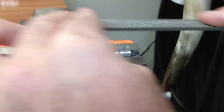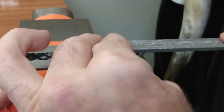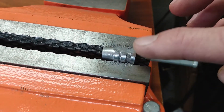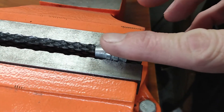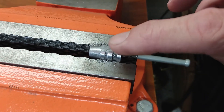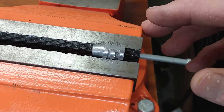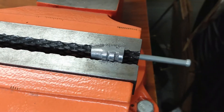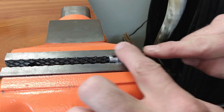You do not want to take a nice finely made American file and plug it up with lead. Now, I've got it filed down pretty well to where the lube grooves are flush — one nice flat spot. The filing leaves a pretty rough finish, which can make it difficult to interpret your measurements, so once you take it down it's not a bad idea to dress it further with a finer file.